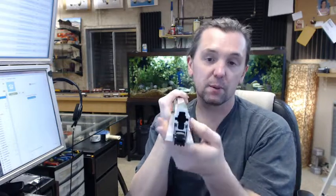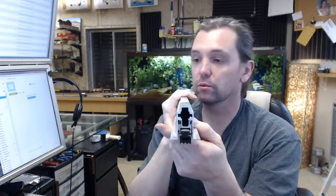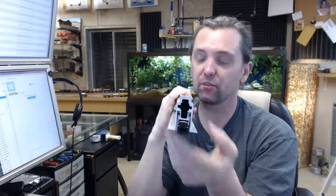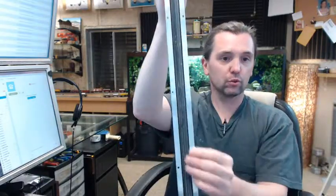Installation — this is a mortise type, it is intended to be mortised to the bottom of a door, probably a wood door. I couldn't think of another construction other than a hollow metal door unless it has been prepped for this, but a wood door. You are going to need to route a channel in the bottom of your door so that this housing can come into it and be installed, screwed directly to the bottom of the door by means of the flanges here. You can see there are holes drilled and you would attach it with the screws provided.